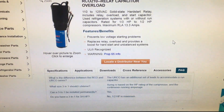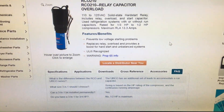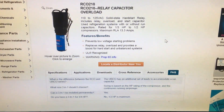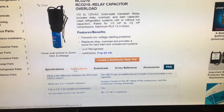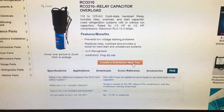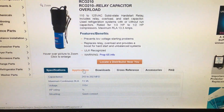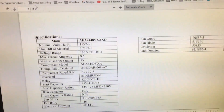Chris at HVACR Videos — I don't even believe that he uses them, so I don't know how he would have any reference point to say that they're compressor killers and that they don't work good if you don't try them. Anyhow, that's all I have to say. Be careful how you size the kits — you must size them by amps. Thanks for watching, please click like and subscribe. Remember: size your kits by the amps, not what it says on the package for horsepower.